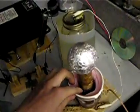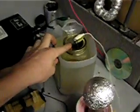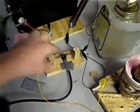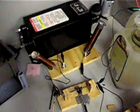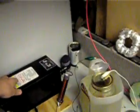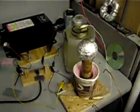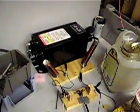The secondary windings are way down there, so you can't really see them. Here's my high-voltage capacitor. My spark gap quenched by a little aquarium bubble oxygen thingy, my 12,000-volt neon sign transformer, and my two high-frequency chokes for the high-frequency — very high. I think it's somewhere around 2 megahertz.